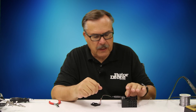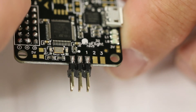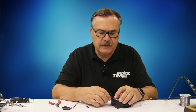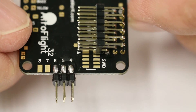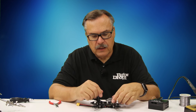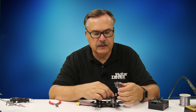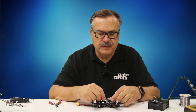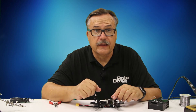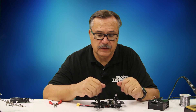There we are - I can pull this off now and I have my pin on this side lining up pretty good. They might warp a little bit from the heat but you can always adjust that. I have these pins coming out the bottom. When I place this back on my quad, all my ESCs are going to come out of the bottom where these can plug in, and my receiver is going to come out of the back and plug right in here. I'll be able to do all my computer programming work on that side, which makes it much easier once the quad is all together.